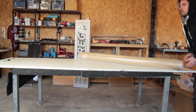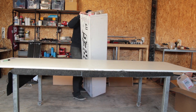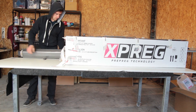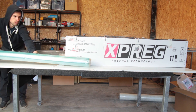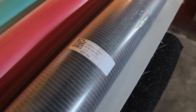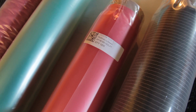Here we have the pre-pregs — various types you can get, all out of autoclave. Keep in mind I'm not using an autoclave, just an oven with vacuum. Here's the second box, and I'll go through the pre-pregs in more detail later. The big box has different rolls — mostly materials for upcoming videos including fiberglass and carbon fiber. Something you have to have is the biaxial fabric — this one is 300 grams, oriented at +45 and -45 degrees. When you back a twill weave with this, you get a uniform laminate.